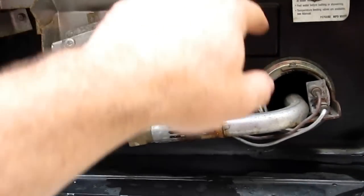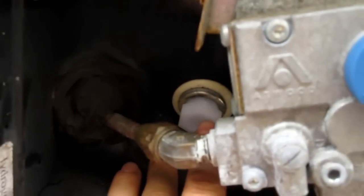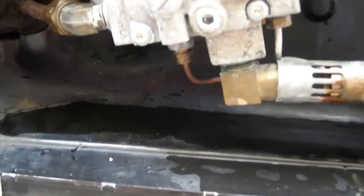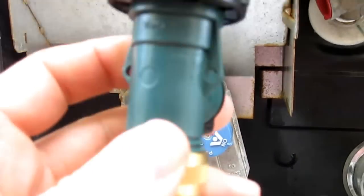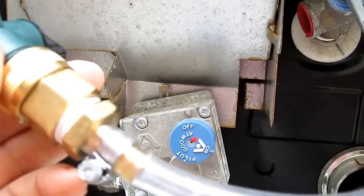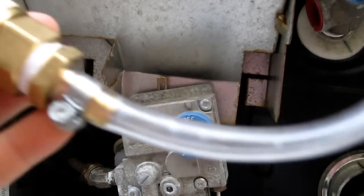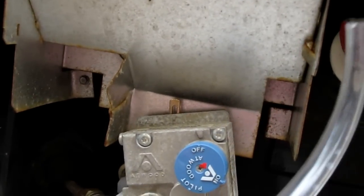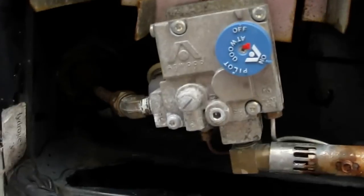After the pressure is removed, then you close this again, then you open this valve again, and you drain the whole thing of the vinegar, and you use your wand again. They actually sell those, if you want. They have one at Camping World, and World Recreation has one as well. They're all the same company. I just made this one myself because the store didn't have it in stock, so I didn't want to wait.